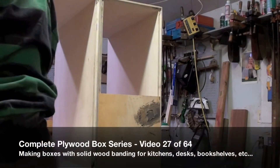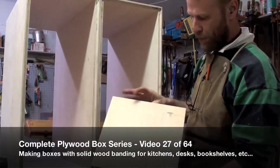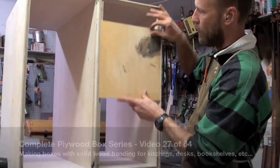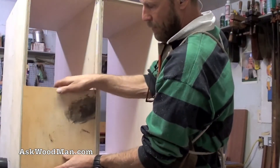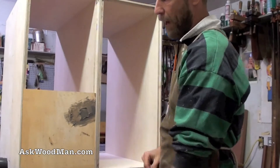I found a partial piece of quarter-inch plywood that's going to cut my backs, but I don't want to make a mistake and waste material. So I just took this piece of scrap — which is actually from our drawing — and it had epoxy on one side. I checked my width to make sure it was going to be perfect for the insides of both boxes. When I make one pass with that piece of plywood, I know the width is set exactly right, and then I'll just bob the lengths down.